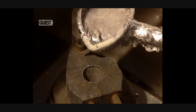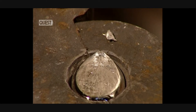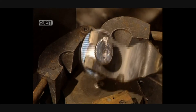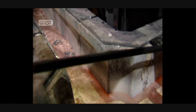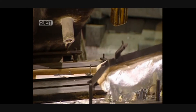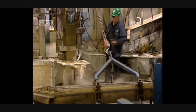A portion of aluminium is poured into a small mould to make a sample. Solidifying in just seconds, the sample allows for testing to verify the contents of the prepared alloy. The now liquid aluminium then travels through a trough to the tapping well, where any impurities are filtered out in special receptacles. Poured into ingot moulds, water accelerates the cooling process. The molten aluminium is quenched and the ingots solidify.